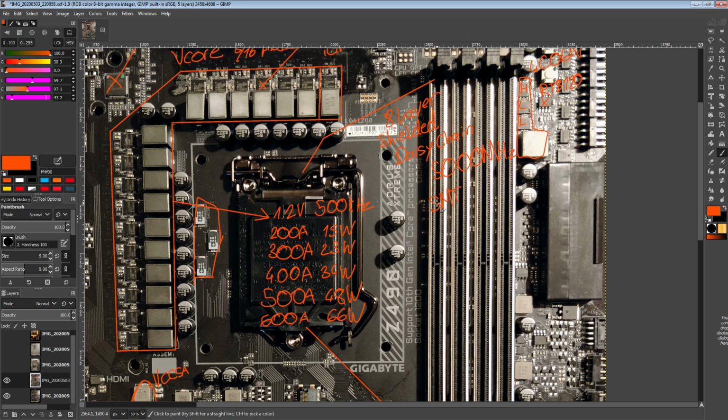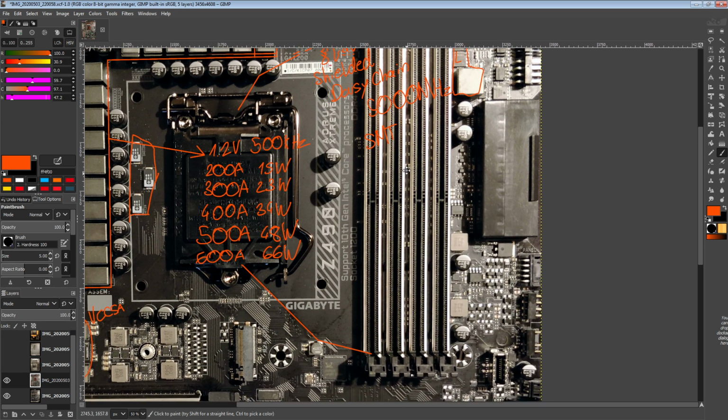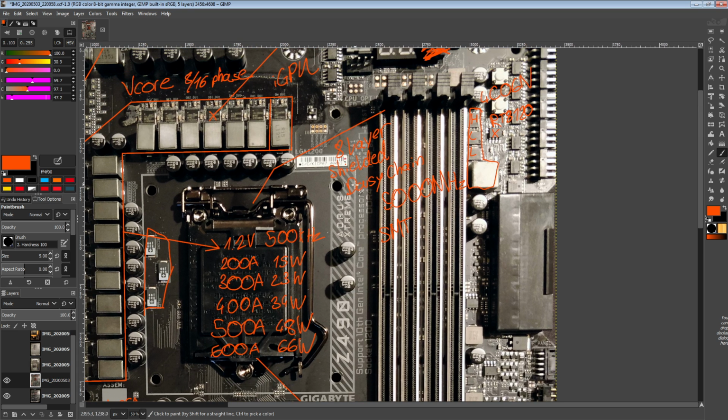Like the Dark series from EVGA did, or does, well, some of it. The Z490 FTW also uses SMT DIMM slots. But I think Gigabyte was actually the very first to do SMT DIMM slots with the X99 SOC Champion, or maybe they even used them before that. With X99, the SOC Champion, they went absolutely crazy to try to get it to clock memory as well as possible, and that I think is the first board I can remember with SMT DIMM slots. I don't think they did a DDR3 board with SMT DIMM slots, but the X99 SOC Champion was the first. So it's really cool to see Gigabyte bring this back, because they did it on the Champion, and then I don't think they did it ever again until now.